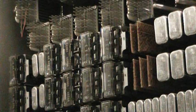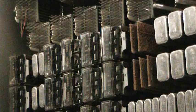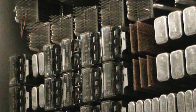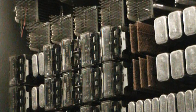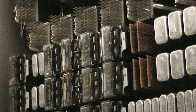These are the slave relays that are working off of the motor interrupter in the central office. We have the 60 and 120 IPM, so we have the 120 here and the 60 here. These relays are opening and closing leads and also interrupting a continuous tone to provide a busy or reorder tone. And there's also timing stuff in the office that needs a pulse, like for a charge condition on an answered call if it was a message rate circuit, which this office does have the ability to do, message rate service, and so we would be using pulses for that.